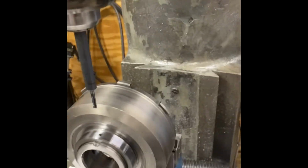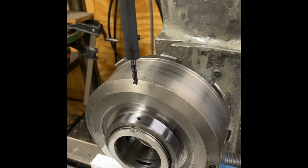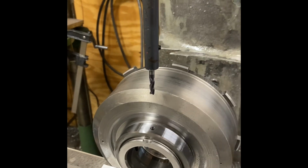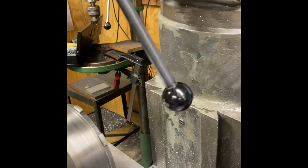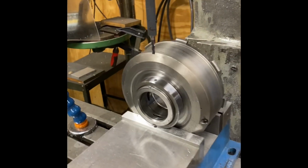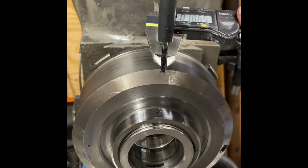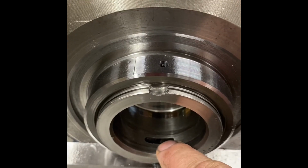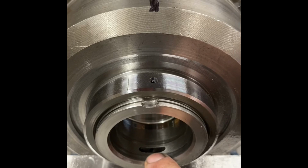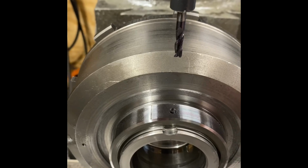Okay, here's what I'm doing for a lube on the Turbo 350 36 element sprag. I have a carbide end mill. It is 3/16. I'm just drilling it in line with the lube circuit for feeding the piston. I only have one in it.